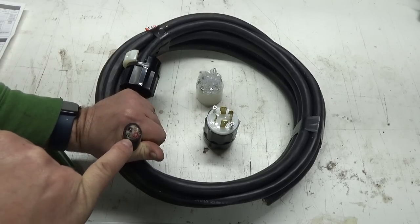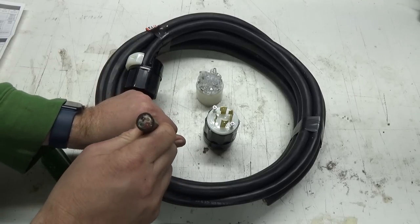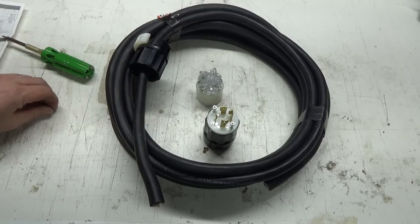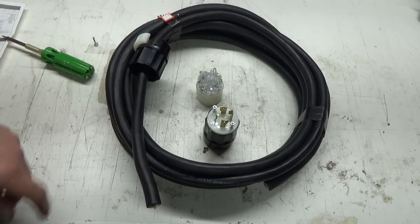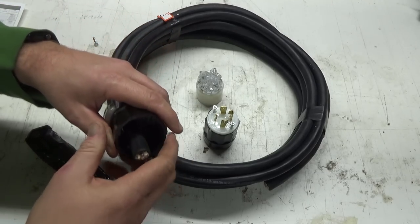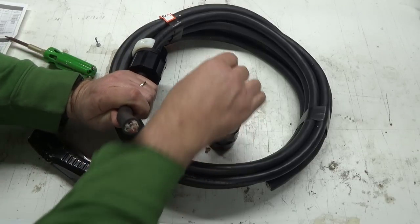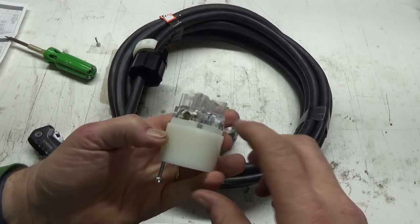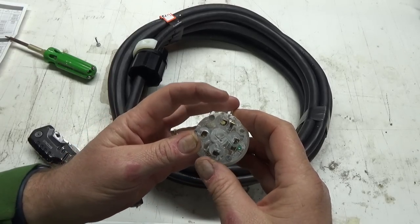We need to strip this back a little bit. This is 24 feet, and it was $16.19 per meter — which is just a little bit over three feet — so that's a lot of money. We need to leave a little bit there, but I'm going to cut it a bit longer than we need and then get all the wires in where they're supposed to go. On the plug here, we've got different colors coordinated — light green for ground, Y and X for your hots.